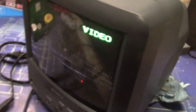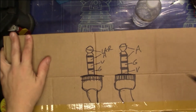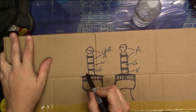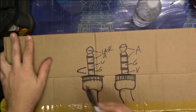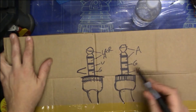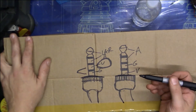When I plug in the audio, watch what happens. See? And the reason for that is pretty obvious. So I should have figured this, but I just didn't. The problem is that even though I switched the ground and the video on the one plug, the other plugs still have their audio going to the video connector. So it's creating interference and I'm not going to get my audio.